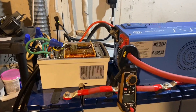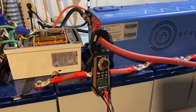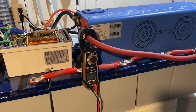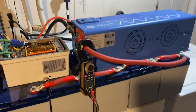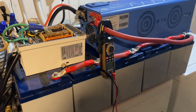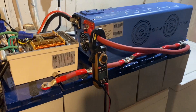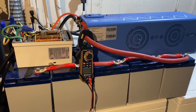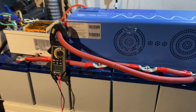When the power's out, I'll cut the main breaker just to make sure nothing's back-feeding the grid, then I can turn the inverter on and I should be able to power the whole house — we're going to try that right now. I would not recommend doing this full time; if you're going to have this as a battery backup full time, you should definitely have it hardwired into your system at the AC panel. I'm going to be turning off any critical or non-critical loads like my HVAC and only running basic electricity, so it won't be pulling very heavy loads. This inverter is actually bigger than what I need, but let's give it a shot.